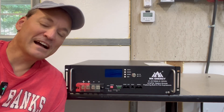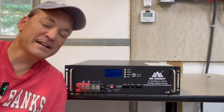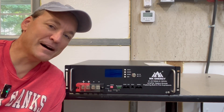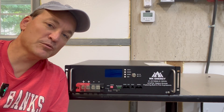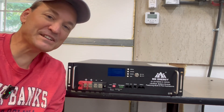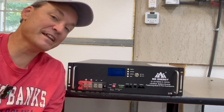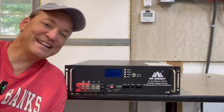So wrapping things up, I do like this battery. I like the fact that you can change the protocol so easily, and hopefully that's something the whole industry will be catching up on. I also like the fact that you can squeeze 120 amps out of this battery, and having the heating option is nice. This battery has a number of protocols, so I'll put a link in the description so you can check if it works with your inverter. A con in my opinion is that it doesn't have a built-in breaker — I prefer to have one on the battery itself, although you'll end up putting one in line anyway. That's about it for this video. I appreciate you guys watching and stay tuned.